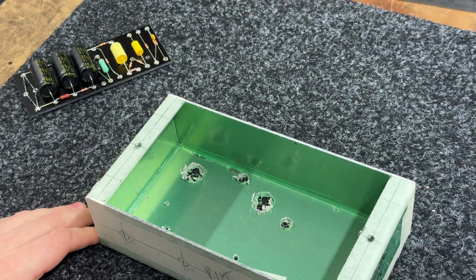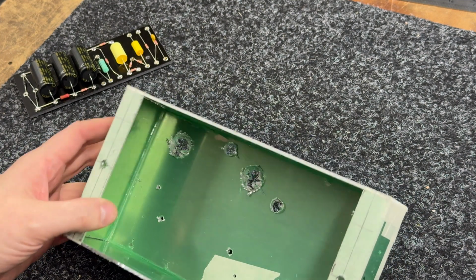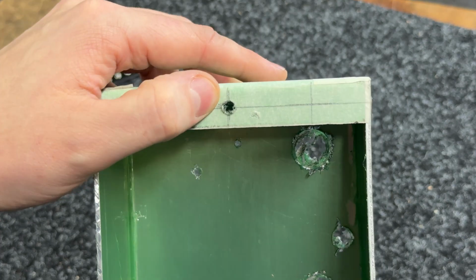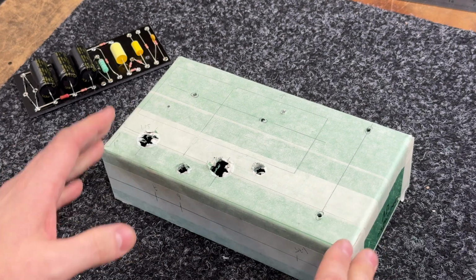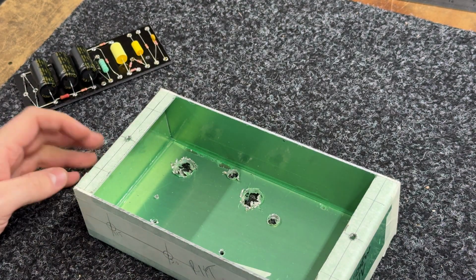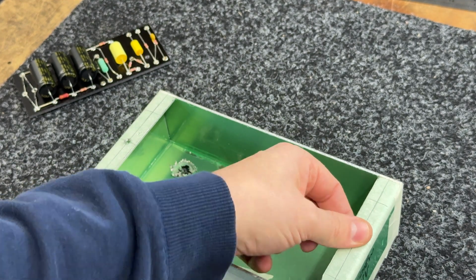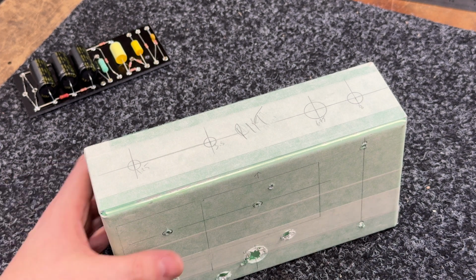So I looked at various solutions about getting a square punch, maybe bits and pieces, but in the end, all I've decided to do is simply drill and tap for some M6 holes. And this is going to be so light anyway, and this is actually going to be a sit on the floor chassis rather than a hang from the ceiling. So that's going to be the way I'm doing that. And I did a couple of test runs, and even though it's 2mm alley, with M6 hardware, it can hold a surprisingly large amount of weight. So yeah, that's still going to be fantastic. I'm really happy with that. So that one's coming along as well.